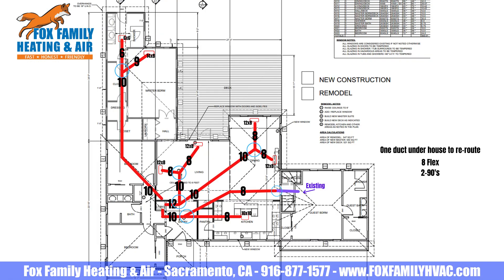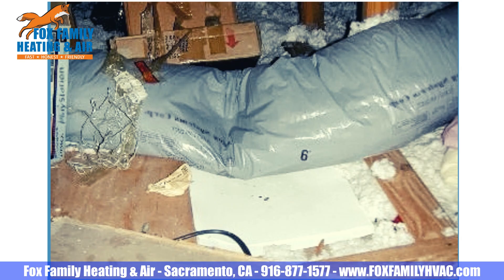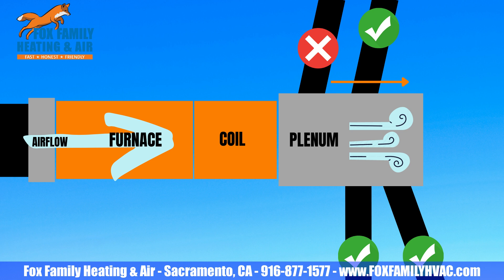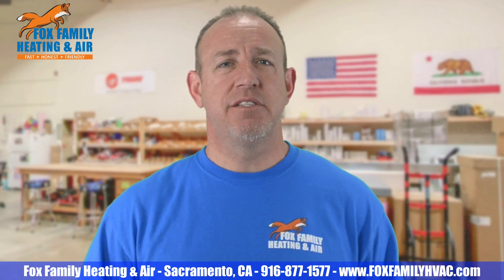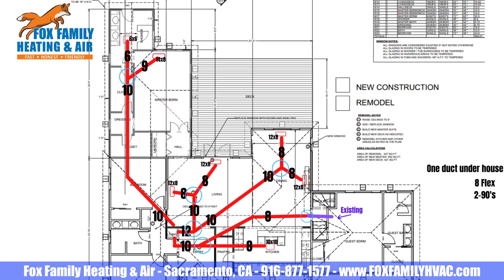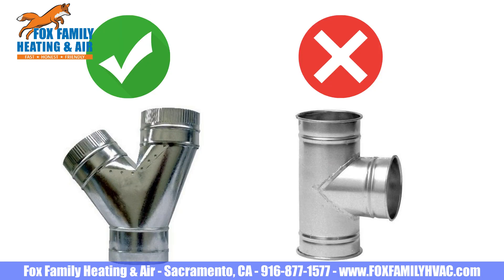If there seems to be a problem with one room not getting enough air, there's likely a problem with the duct system or its design. Maybe adding a larger duct to that south-facing room will deliver the right amount of air — that might also mean enlarging the C-box and the supply register in that room, but not every time. Are any of the ducts crushed, especially the return duct? Maybe the supply duct is in a poor spot on the supply plenum, so it's an afterthought for the air entering the supply plenum — the air hitting the back of the supply plenum will always get the most advantageous airflow. Is the duct supplying that room attached to a T-Y? Is the Y built correctly? Does it split off at a 35 to 45 degree angle, not like a real T and a sharp 90? KD pipe with a hard 90 won't allow the air to divert towards the duct — it will take the path of least resistance, so make sure you have a good T-Y connection.